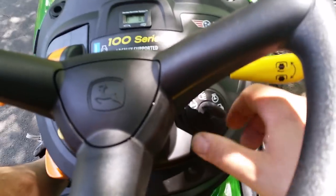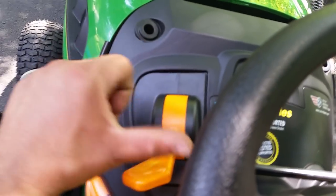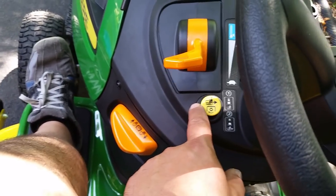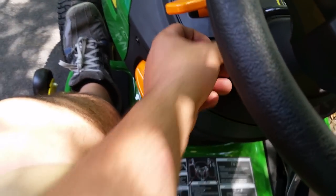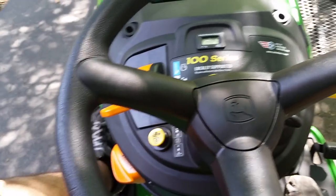You've got your ignition. Your throttle is to the left, and on a cold start you're at full choke — all the way up — then bring it down and adjust your throttle. Good to go. This button here is for mowing in reverse — it's a push. You're able to mow in reverse; it's really a safety feature for when you have to mow backwards. And then your mower deck engagement is right here — you just put it up.